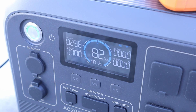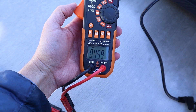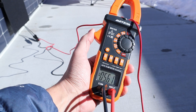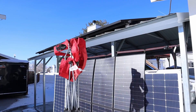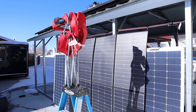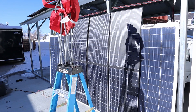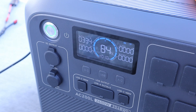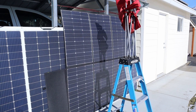The inline voltage when partially shaded is right around 45.9 volts, and we're seeing around five and a half amps. I also moved the shade to cover the two far right panels — we're getting 335 watts. Then I moved the ladder and chair to shade the two middle sections of the solar panel, and with the two middle panels shaded we're still getting 338 watts.